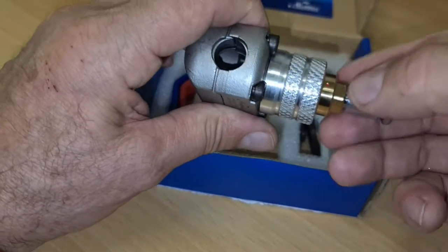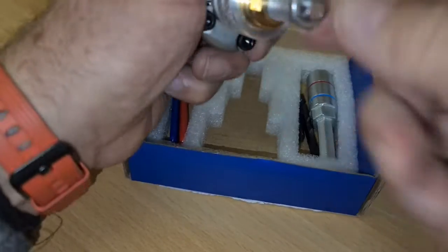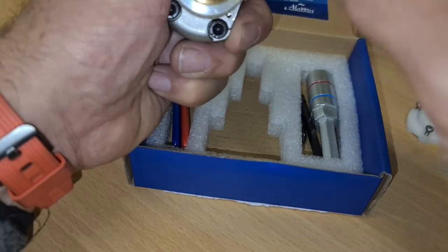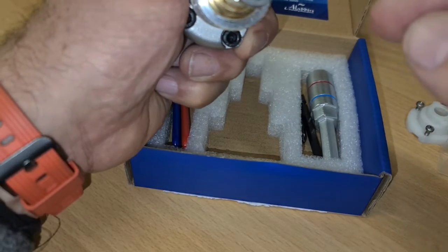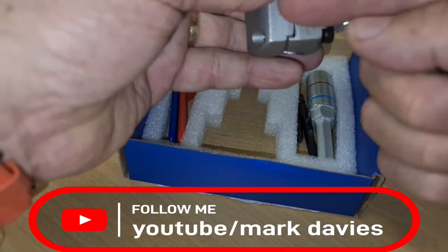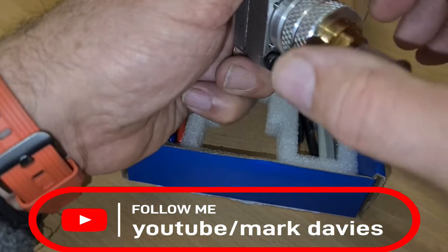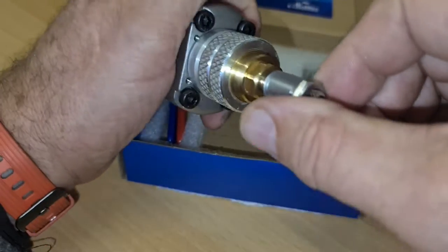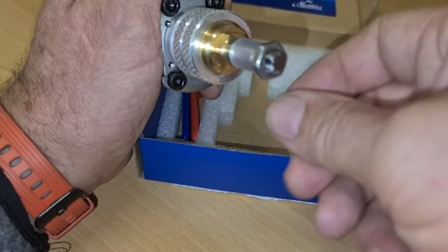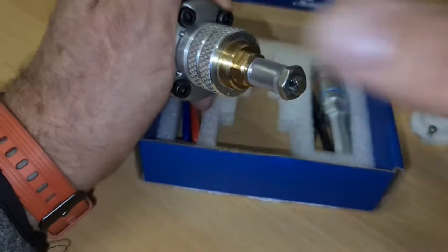There's a little dot there, and you want that little red dot to line up with another dot which is on this casing behind. Once you've taken this off, this will be driven home, all the way inside, well, most of the way down here. Undo this, and this dot should line up with another red dot just inside. If that's the case, you can get a spanner and go either way with it till it's lined up. It'll stop when it gets down where it needs to go.